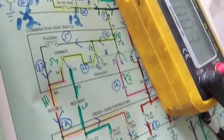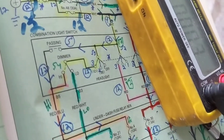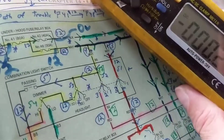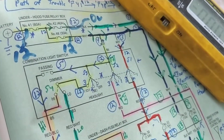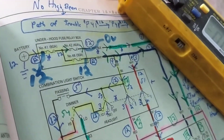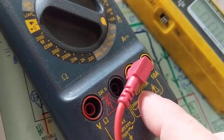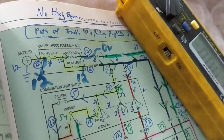There's no need to put the clamp meter in series if you can clamp around the wire — it's the next best thing to measure current. If I put it on the wire in the wrong direction I'll just get a negative reading, which is no problem — I'll just turn it around. Anyway, always be correct about your amps, and understand what milliamps means. There is a great difference between one milliamp and one amp.